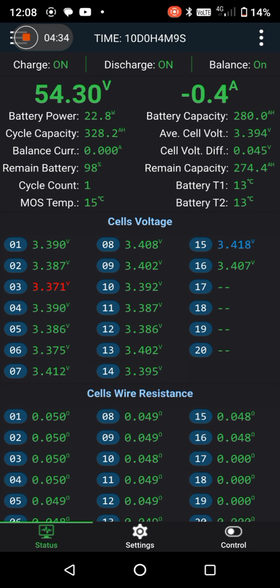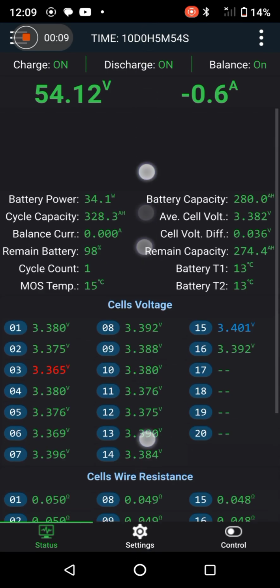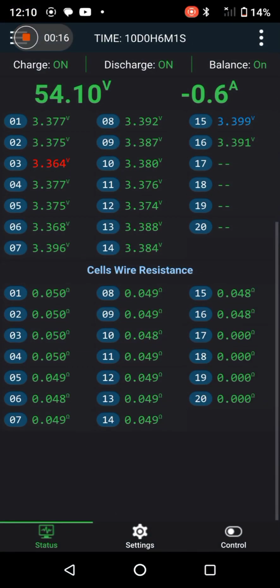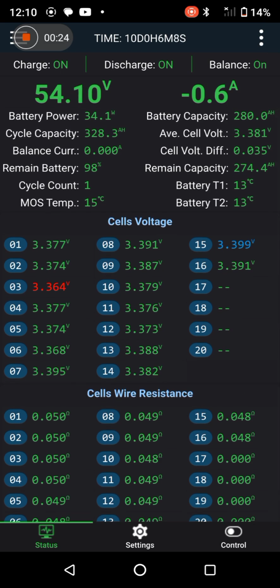The cell voltages are starting to drop, so I don't think they're fully absorbed. Yeah, as Andy would say, the voltage isn't fully absorbed. I don't think it's sticking yet. See how quickly that ticks down. So the voltages on the... Oh, don't start having a freak out. Every now and again, the screen gets a bit greasy and has a bit of a freak out. So the overall pack voltage and the cell voltage is dropping on the left bank. So they're not fully absorbed yet.